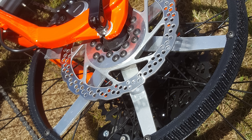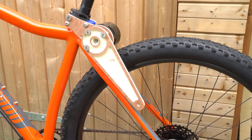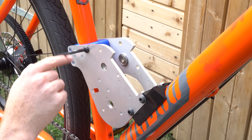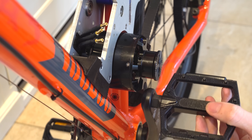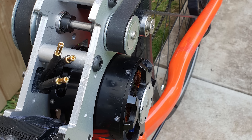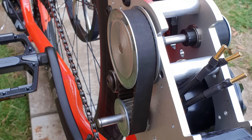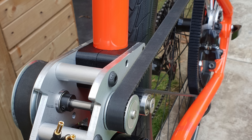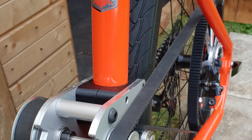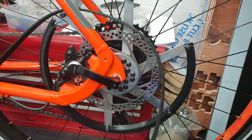With a total of six spokes and a 3D printed tooth pulley, I worked on the motor mount again, realising it needed a full redesign as I wasn't comfortable with the long arm potentially twisting into the rear wheel. The new design utilised the water bottle mounting bolts and a clamp around the seat post, keeping the motor protected inside the frame. There were two belts instead of just one to gain a larger pulley ratio — the first belt producing a 2:1 step down and the larger belt a 37:4 step down, giving a total motor-to-wheel ratio of 18.5:1. This produced so much torque that the pulley exploded instantly upon testing due to a weak design.